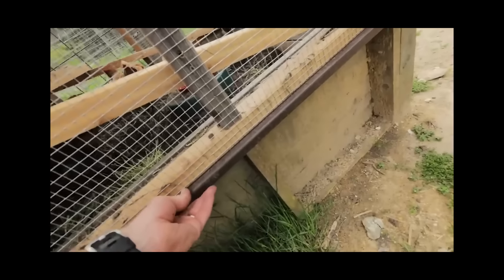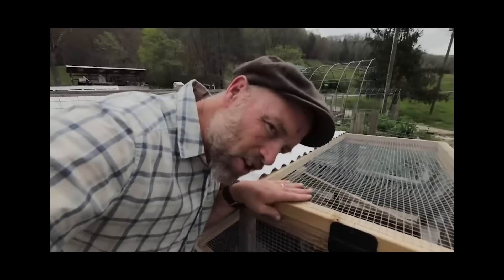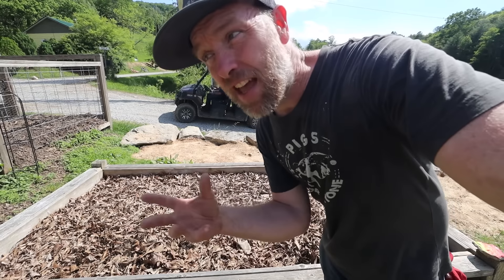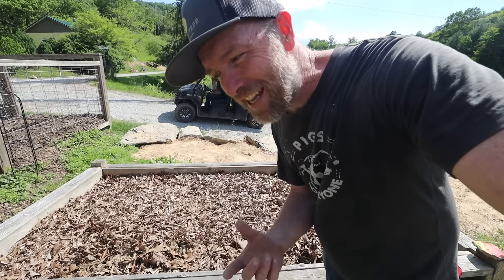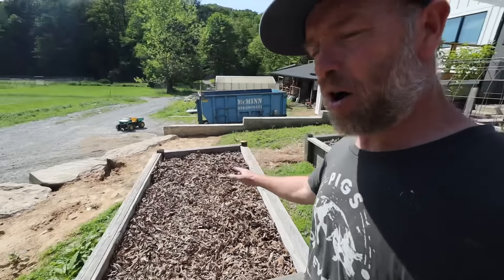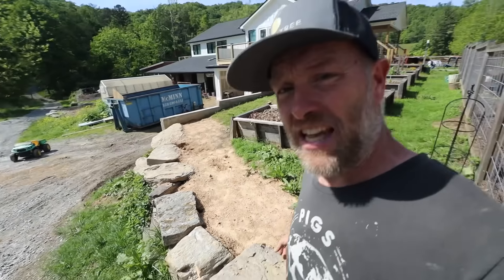There are three perches so 12 birds could fit comfortably in there. This is cedar wood two-by-fours ripped in half, so all these are two-by-twos. We used half-inch wire mesh - sturdy, not the flimsy poultry wire. Make sure you have your lid clipped. You can open this and you don't have to get in there to clean up any poop. Corrugated roof panels in white - you don't want your chickens to get too hot.